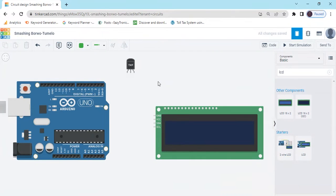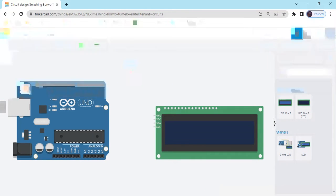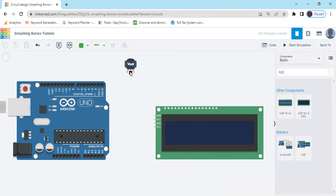Now there are 3 pins for the sensor. First is power, 5 volts. Second pin is the output, connect to the analog pin A0. You can connect A1, A2, A3. And last one is ground, connect to the ground of Arduino.